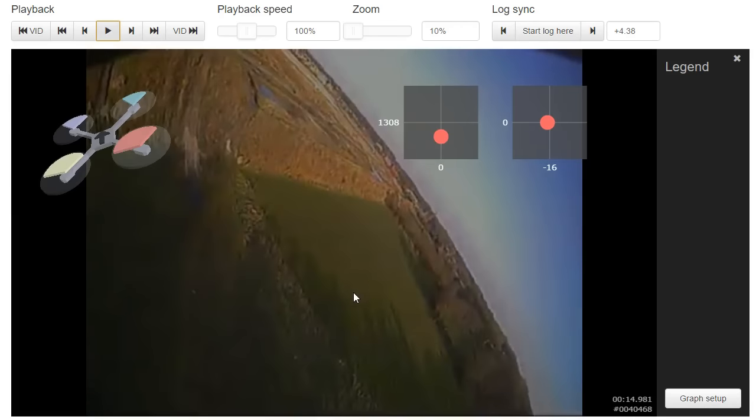So let's talk about some things that could cause that. Well, first of all, it's not oscillation. I don't call that oscillation because I think oscillation has a regular characteristic to it, and it's got a consistent frequency, and that is more sort of random. I sometimes call it a skitteriness or a buffeting, like driving on a rough road and kind of bouncing a little, but it doesn't have the consistent frequency of a P-term oscillation, where it's like bop bop bop bop bop bop bop bop, right? This is kind of random. It's like twitch twitch twitch twitch twitch twitch. Okay, so that's probably not P gain.